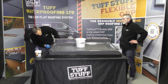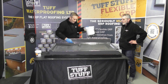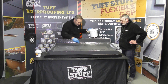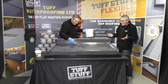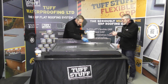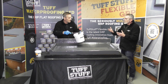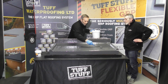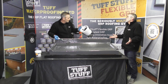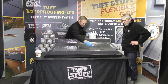So I'm nearly ready to do the field area. We let the roller do the work — when you load up, you don't want to be pushing on that roller to make it coat. I'm putting no weight on it at all and that's giving me a nice even finish. As we're doing it, we're looking to make sure we haven't got any pinholes. If we saw any pinholes while we were sanding, we can put a little bit on there just prior to top coating. When the roller's not making any noise, the quantities are right — it's when it starts to hiss a little bit that there's not enough liquid on it. This was about 0.75 of a metre for the field area, but you take into account all your trims and upstands — it's closer to a metre — so we're pretty much spot on, having used almost all of this.